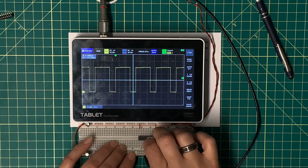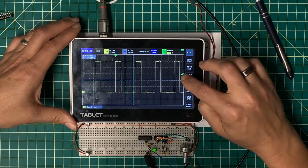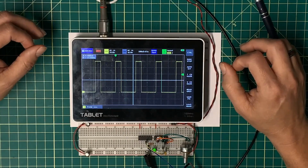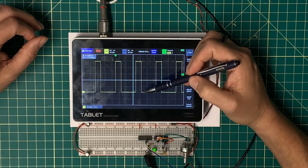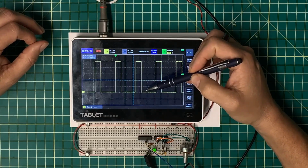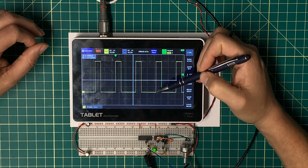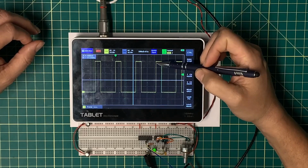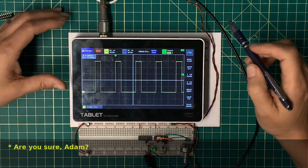And then measure the output of the inverter. It's jumping around a little bit, but that's a little bit better because now on the falling edge, I can increment and latch, and I've got a much wider space to resolve that new address before I latch it at the fetch register. So I think that's going to end up working out better for me.